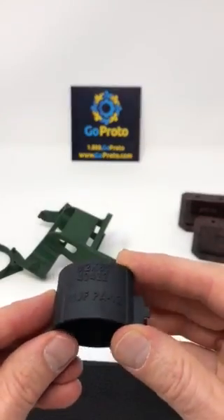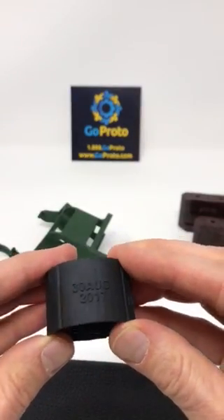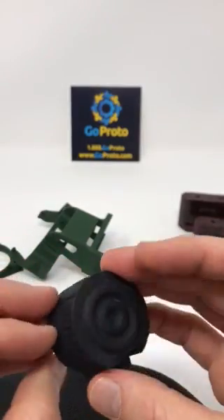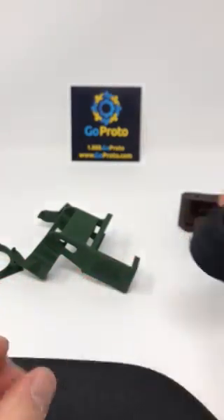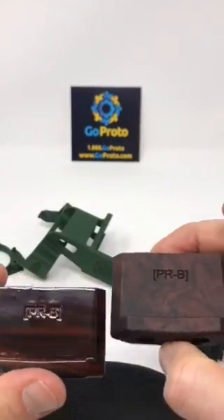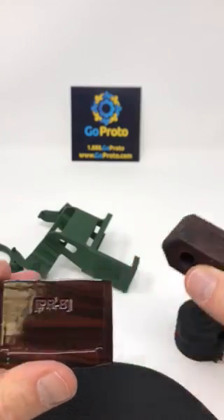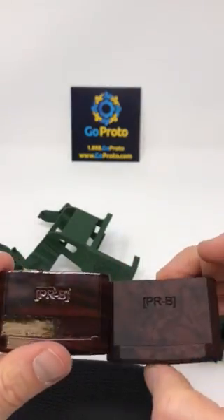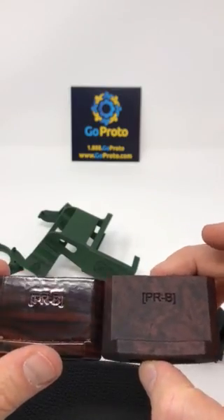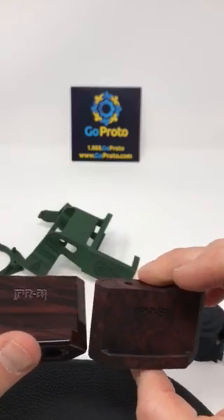This part is dyed black. It has part numbers and the manufacturing date directly on it. You could have lot numbers and lot traceability with this. This part has the part number printed directly into it. And then this part is hydrographically dipped — this one is non-gloss, this one is glossy. You can see there's a little bit of difference in resolution after it was dipped, but the part comes out excellently with the part number directly on it. No chance of it ever being removed.